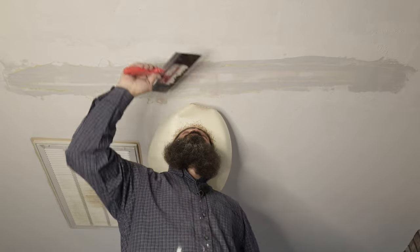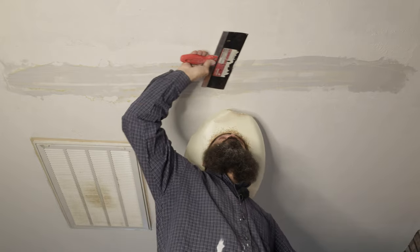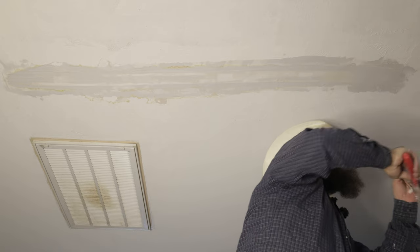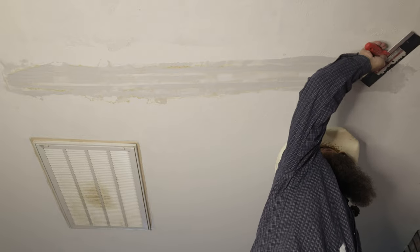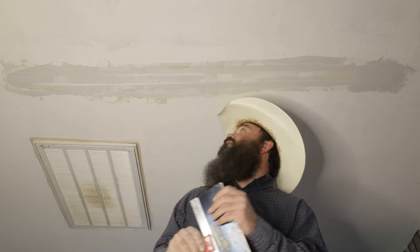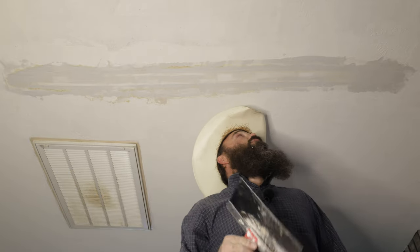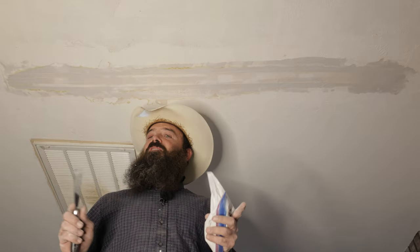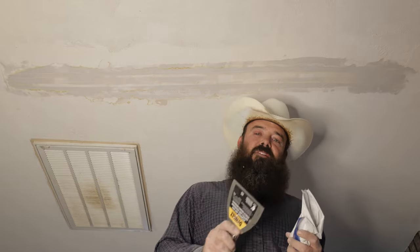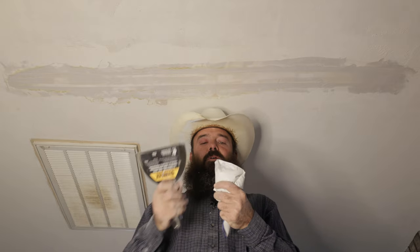No sanding, and I'm pretty satisfied right about here. This is going to be more than flat enough for us to do at least our first skim coat — we'll see if we need two or three. We've got another batch of hot mud mixed up here. I made this one relatively thin. The next batch might be a little thicker, but this one's kind of in between normal consistency and the really thin mud we used to make sure the tape bonds well.